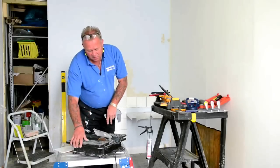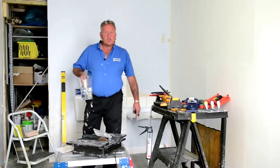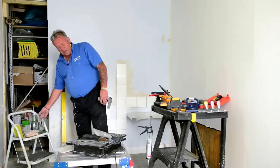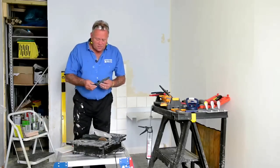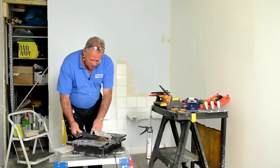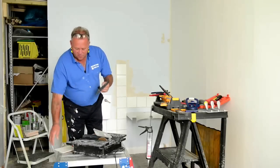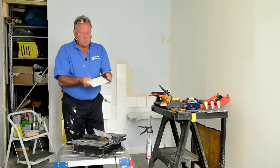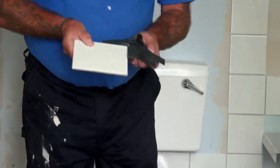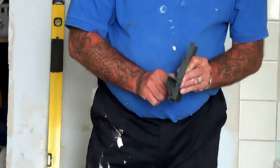You simply lift one side and tip the water in. Keep a jug of water handy because the water splashes out and you lose it fairly frequently. They nearly always come with a sub guide which clips onto the straight tile guide and allows you to cut the tiles at an angle — you simply put the tile in there and as you slide it up the runner it will cut at an angle for you.